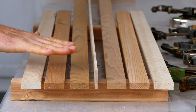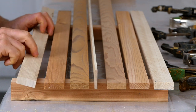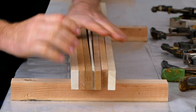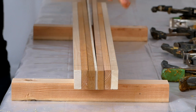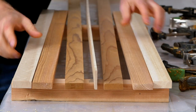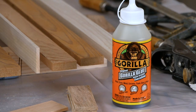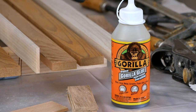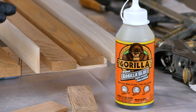If you're working with Gorilla Glue and you've just moistened these surfaces, the next thing we're going to do is flip these pieces over so we can put glue on the other side. For the benefit of everyone who's not working with Gorilla Glue, I'm just going to reverse this process and stand these pieces back up. You're looking at that black line that we drew all the way across the top - this is your starting point if you're not working with Gorilla Glue. Next thing we're going to do is turn these pieces outward so the black lines are all facing to the outside, and then we're going to apply glue to these surfaces, but not the center piece. Before we start gluing, every glue is going to have a different cure time, so if you're working with Titebond III or G-Flex, both of those have a pretty long open time, so you shouldn't have any problems getting this done.